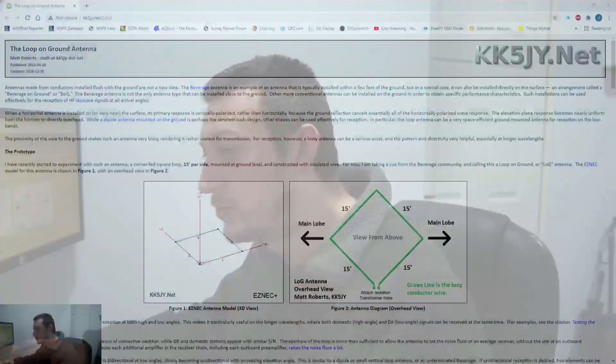You have to be really careful with your switching, and ideally you also want to cut power to that amplifier so you don't overload it when you key up your radio. That introduces a lot of complexity, so I've been looking online and I've come up with this other potential idea — let me show you my screen.